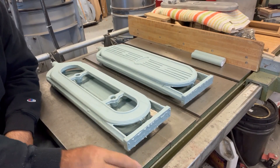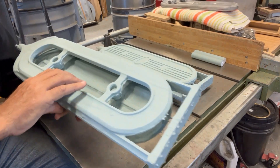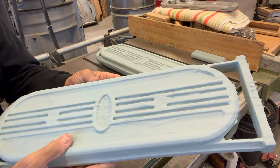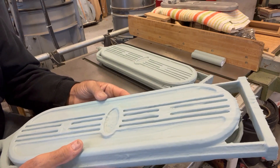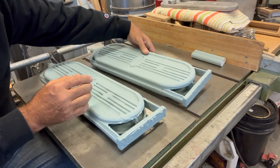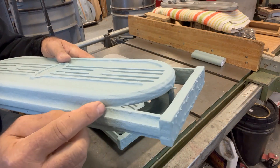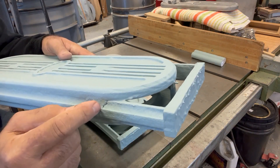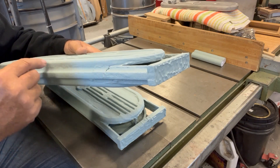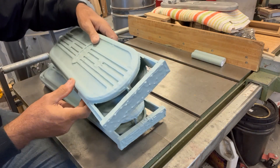Back with you. Got the patterns dip coated and they're dried. I got a nice uniform refractory coating on there, everything turned out well. One thing I will comment on - I mentioned how heavy these things get when you initially dip them. I put these pieces on here for handling and whatnot. Even with all that, I still almost broke this one. I don't know if you can see that little crack right there. Handling it down here by this end, it was so heavy and I have a pretty good lever arm here. I almost broke it. But given that it's down here pretty much right at the end of where it attaches, I think it'll be fine. I'm going to cast it as is.